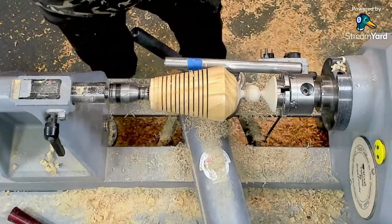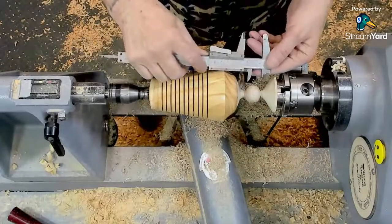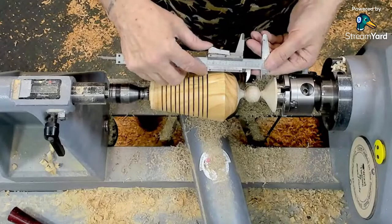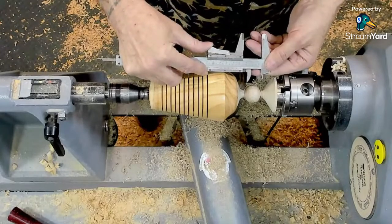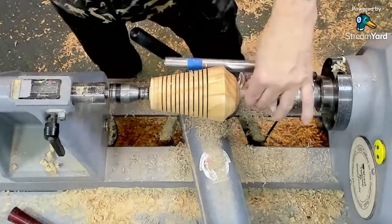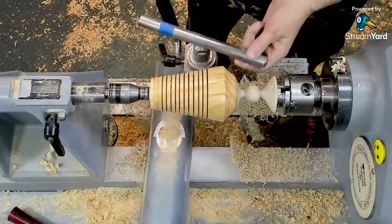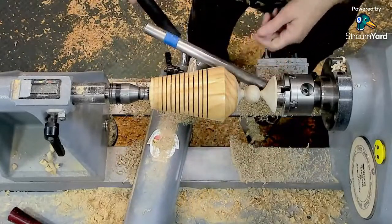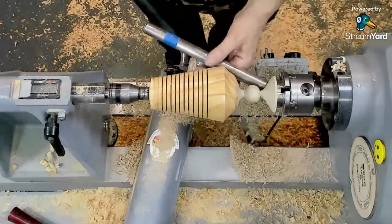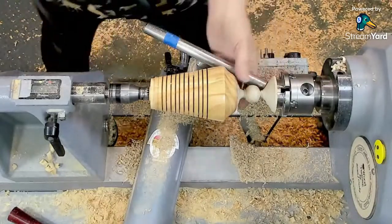That's 28 mil, guys. Am I going to live with that, 28 mil? Leave it at that. Sand it, it'll be 25. Got to sand it. If you get a catch on it, then you'll be wishing it was 28. Yeah, but it's not quite right. It looks good. It looks right. I'll sand it. It'll come away quite easily. I would sand it. Right, so the next thing you do is take that away.